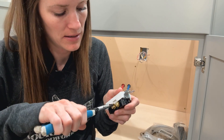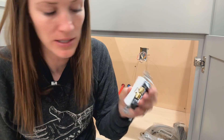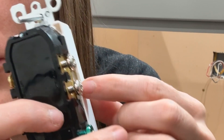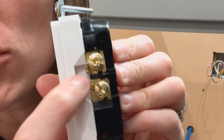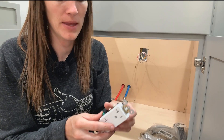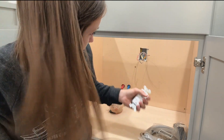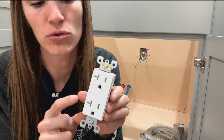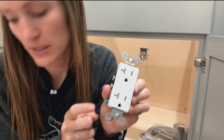I'm going to see if I can bend the tab out without needle-nose pliers. Got it — took me a second. You might want to look up a video on the cleanest way to do that. Now see how those two brass sections are no longer connected? Be careful because mine broke at the front of the tab but the back was still connected — make sure that connection is fully broken. Now I'm going to put my red and my black on the hot side, making one always-on and one switch-controlled, and put my white neutral on the neutral side.